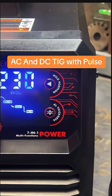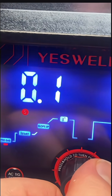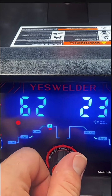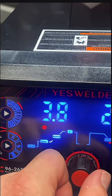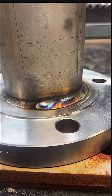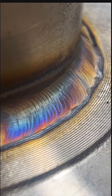Let's switch the mode over to DC TIG and set it up. I'll give it 0.3 seconds of pre-gas to clear any oxygen out of the lead, and I'm going to weld at about 140 amps as I weld a scrap stainless flange. I'll set a 3-second downslope and 7 seconds of post-flow to cool that weld down. Not as many settings as the top-tier welders, but a huge step up from their old machines that just had an on/off switch and an amp knob.